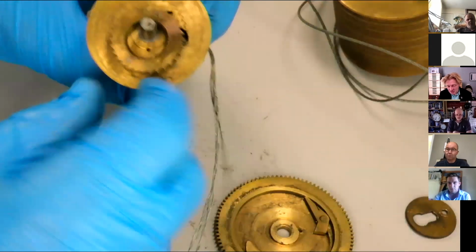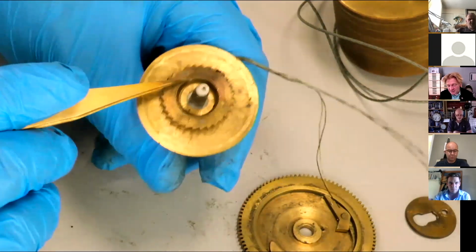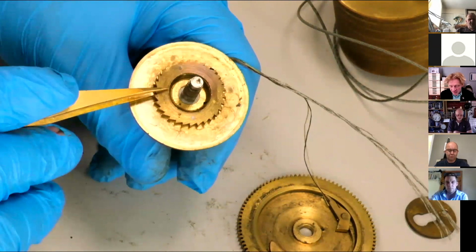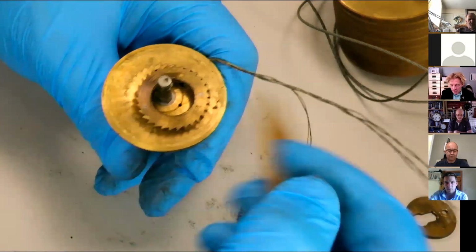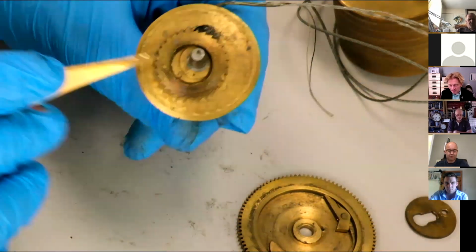I've just done a watch, and I'm going to put a video out on one of my many YouTube channels where the winding ratchet wheel has been soldered onto the back of the cone. These are sometimes screwed, and the screws have points on them. They screw into blind holes, but normally they're like this, and they just fit on. And the holes are normally asymmetric enough that they won't fit round the wrong way. As you can see, if you assembled it like that, you're going to have a problem. So all that stuff off there.